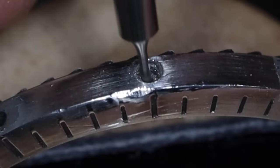Now we can install the hour hammer spring. And I've lubricated the points on the hour hammer and hour hammer operating lever as per the technical sheet, which I seem to have lost on this clip somewhere. Now we can go ahead and install the calendar platform.